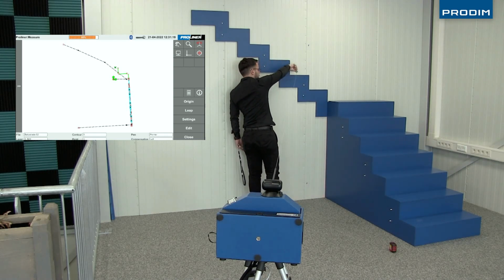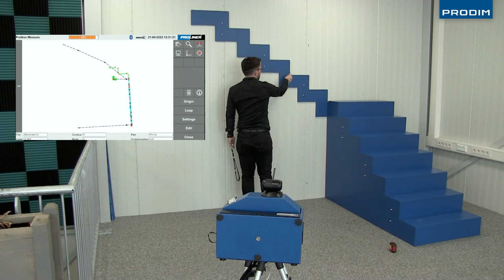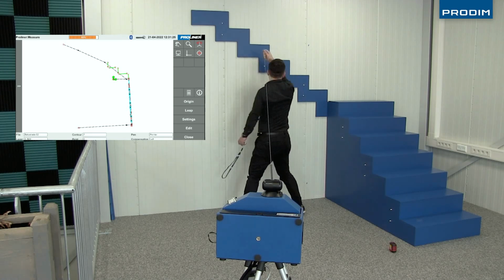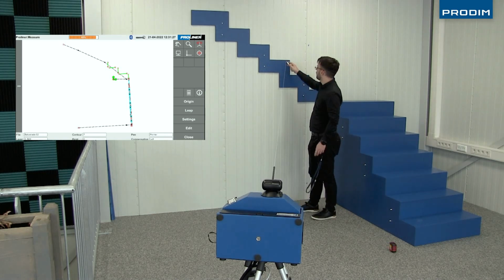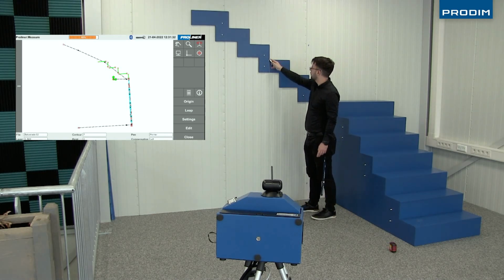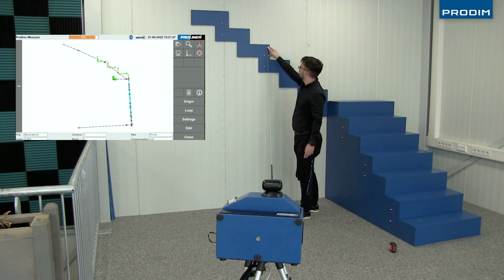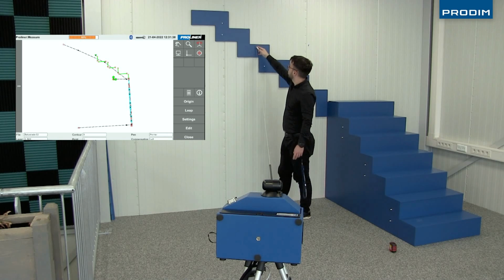Just like the first set of staircases here, we are measuring all the treads and risers, capturing all the information necessary to then build that staircase many different ways, whether it's going to be done with standoffs, with cleats, or even if it's to fit between rails.